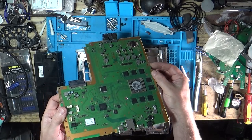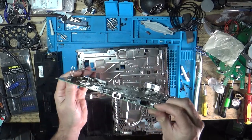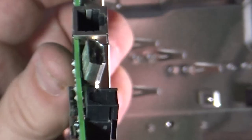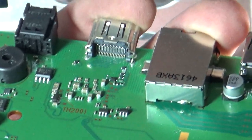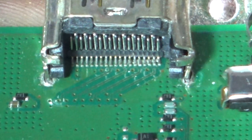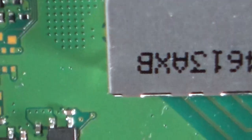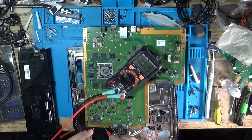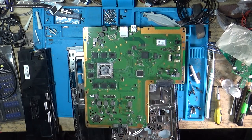Apart from that I'm not seeing much wrong with this board. The HDMI port has been — that's not meant to be bent up at that angle, is it? I'll have to get my microscope on that. It's all bent up, so it definitely needs a new port. Would that be the reason it's not turning on? On our rusty old battery here: 2.8 volts. That battery's no good — that'll be changing, if we ever get it working.